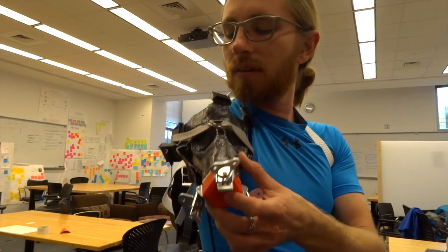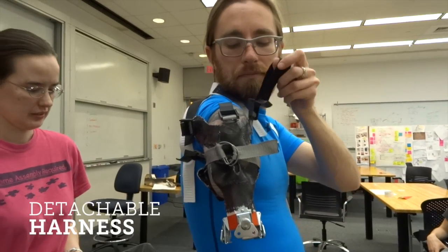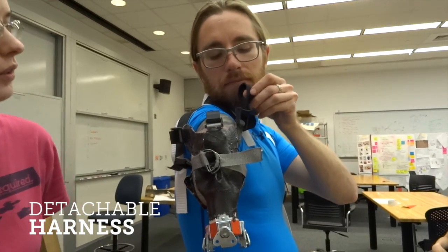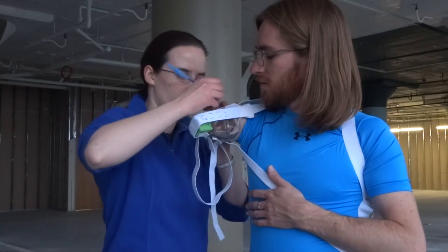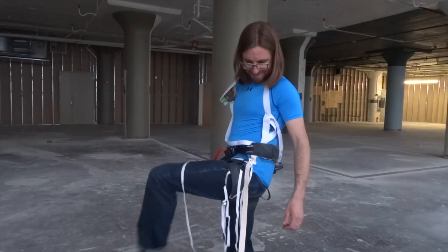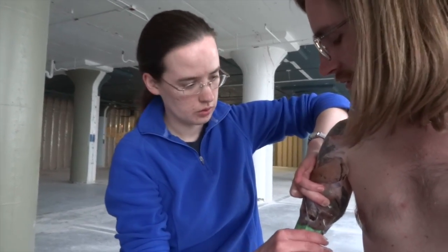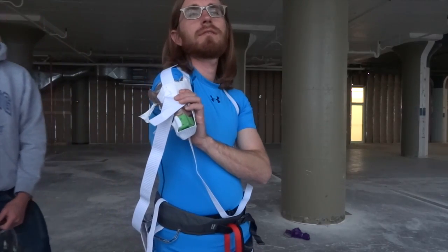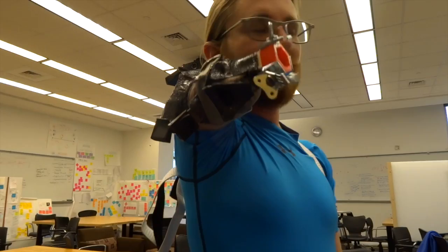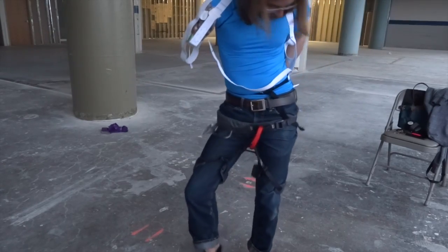Chris mentioned that he'd rather have a sturdy and reliable socket than a purely aesthetic one. It needs strong attachment points to both the arm tool and the harness. A spandex shirt served as a simple base upon which we sewed both elastic and rigid straps to provide a strong yet flexible harness for active wear. The elastic straps provide constant tension to keep the socket in place, and the rigid straps are backup supports for cases of extreme loading. To keep the design modular, the harness straps attach with quick-release buckles to the socket, and leg straps can be attached for overhead loading.